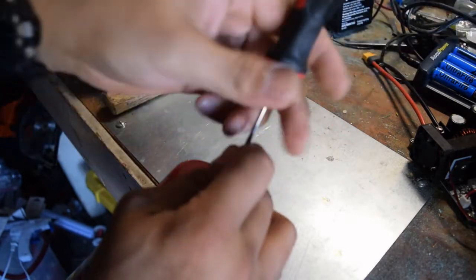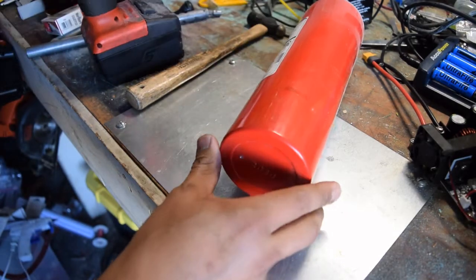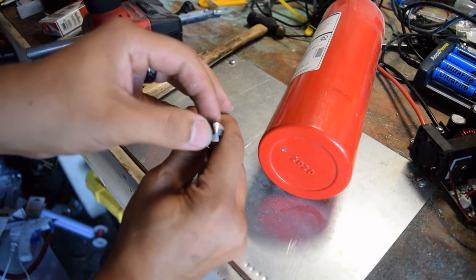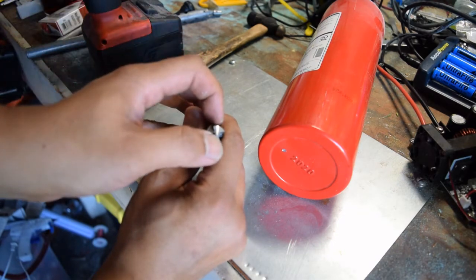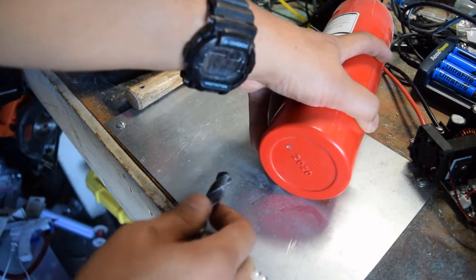And what this is going to do, it's going to push in that little bit of metal inside the middle. If you can see, it's more pronounced on the bigger drill bit. If you can see that there's a part on this bit that's actually flat. And if you're just spinning around on that, you're just going to be walking all over the piece as it spins. Pro tip, mind you.